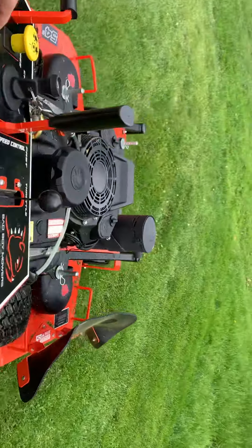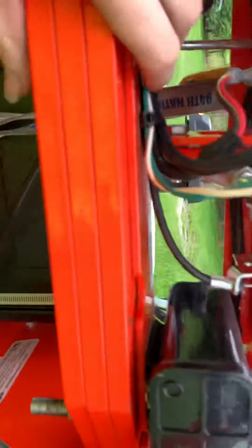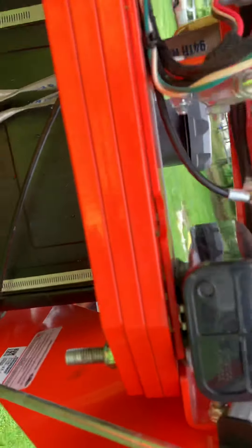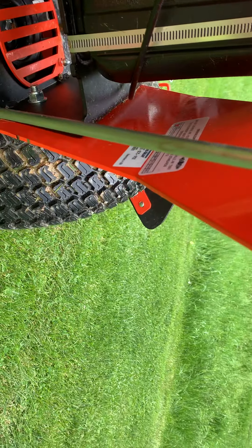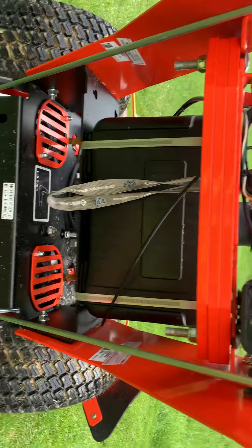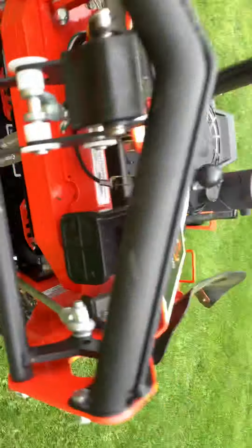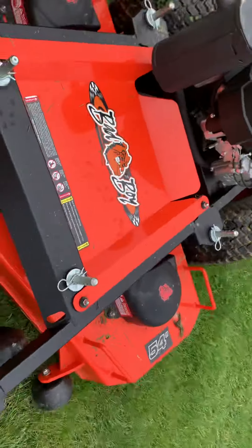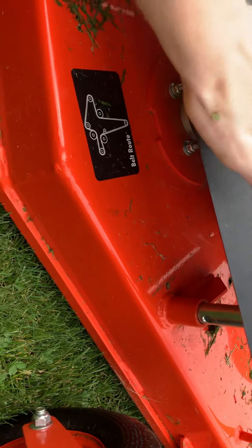Normally these will have a sulky on the back of them if you buy one. But you're going to have these weight plates — each one is basically a standard plate, almost like plate steel. These counteract the weight when you don't have a sulky — they act as more weight on the rear end. But once you put a sulky on, which goes right here where these pre-drilled holes are, you're going to want to take all these plates off. On a lot of these Bad Boys, you can order an extra kit that supplies a special bracket, and you can take those extra weights and put them right here on the front of your machine.